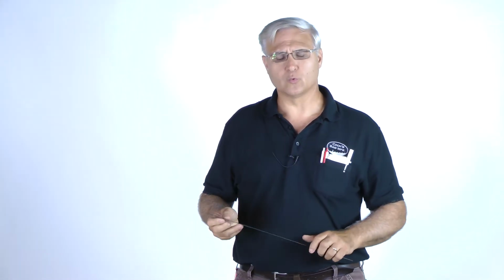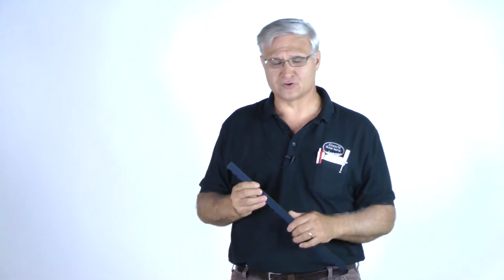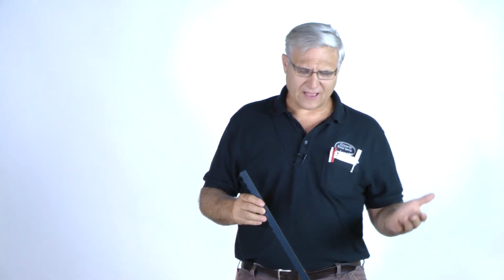We're saving more wood. Another thing about thickness that's important ties into the sawmill that you're running. The thinner the blade, .035 is the thinnest we deal with. Now if you get into hobby shops and garage bandsaw blades, they go on down, I'm not even sure how low, but .020 I know. But the thinnest we use is 35 thousandths. And we have 35, 42, 50, and 55. If you get a 55 thousandths blade that's 1.5 inches, you don't need to run it on a 19-inch wheel.